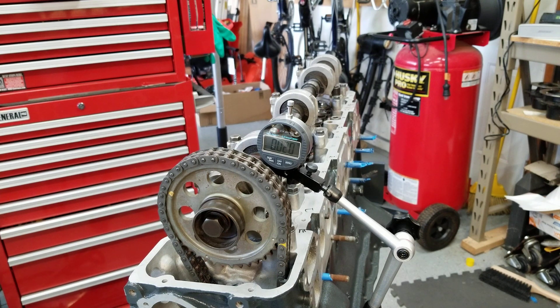I'd say it's pretty good. I'm going to leave it. With this particular sprocket I can only advance it, not retard it — which is what I'd need to do since it's slightly advanced by about 2 degrees. I'm going to leave it on the number one timing mark position. If I feel there's too much bottom end and not enough top end, I can swap this sprocket for one that gives adjustment in the other direction. Thanks for watching!